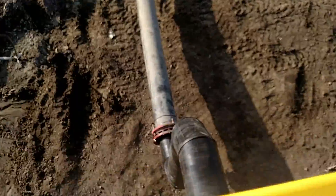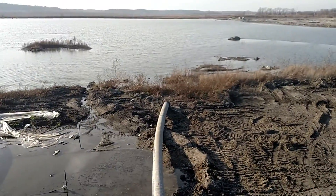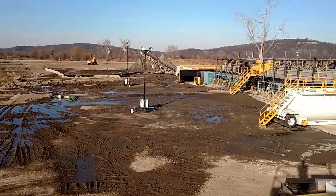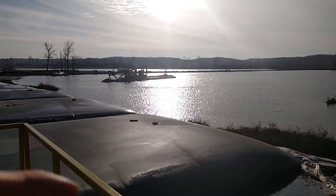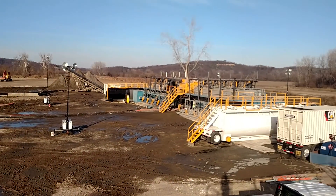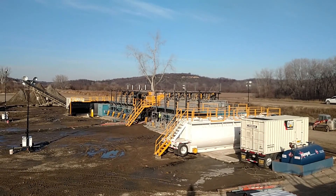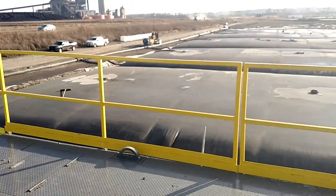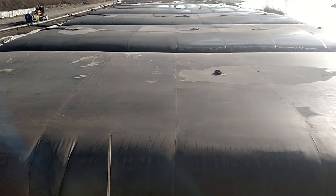Clean water overflows through this 16 inch piece here back to the pond. The site they're dredging is over here — feed comes into a shaker screen box to a fines recovery system, and that's fed into this clarifier. The underflow goes into these dewatering bags.